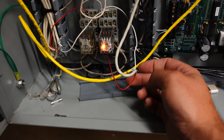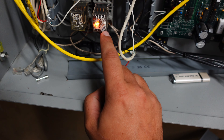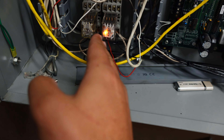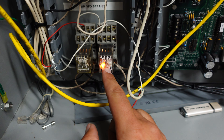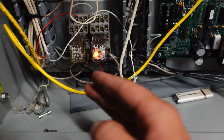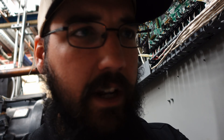Sorting through all of this — it's not a perfect match, but we had some schematics that were very useful. After tracing everything out, we found that in one convoluted way, this is the main relay cycling both the compressor and the pump. On terminal 3 of this relay it's doing the pump, and on terminal 1 it's doing the compressor start-stop. After the pump shut down while the compressor was running, it ended up tripping on high head pressure. I was watching this — the compressor would turn on but the pump wasn't turning on immediately. I started flicking the relay and could thump it. As soon as I thumped it, the pump would turn on, get start-stop at the drive, and start to ramp. Thump it again, it'd turn back off. Thump it again, it'd turn back on.